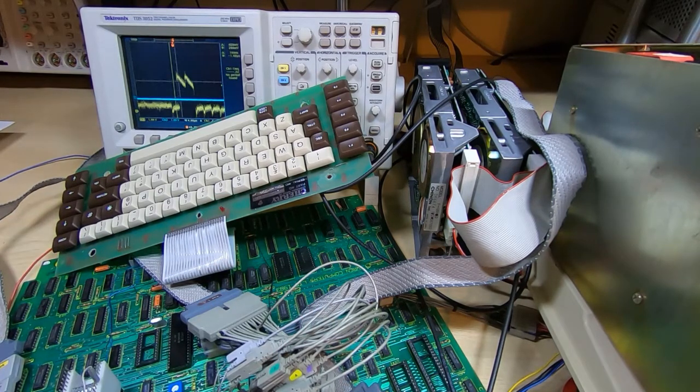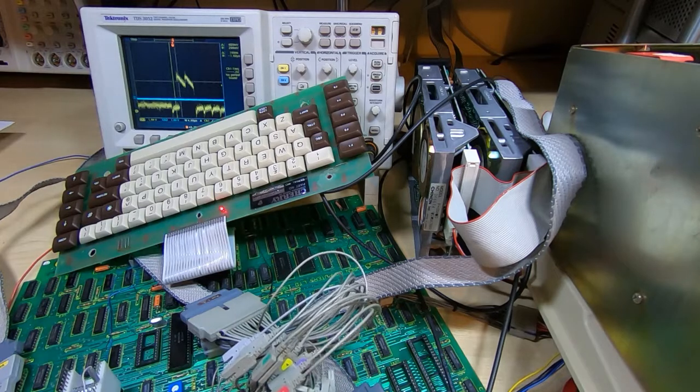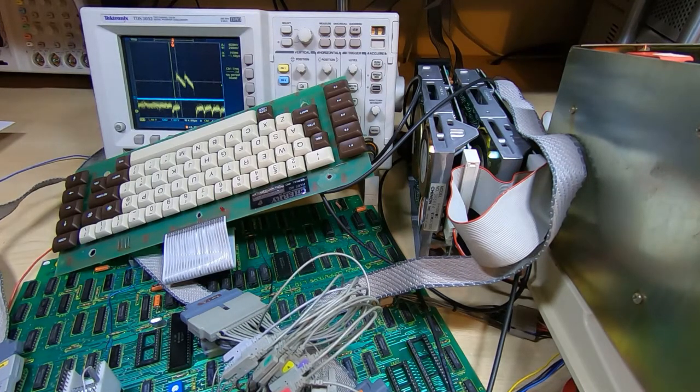Now it is possible, of course, that one of the peripheral devices I currently have removed is responsible for killing the buffer chip. So what I'll do now is refit them one by one, and if the buffer chip does fail, it's not too bad because it's in a socket rather than soldered in. So although you can't see it, I've put a socket in there, so it'll be much easier to change in future.